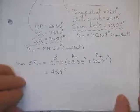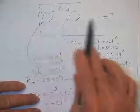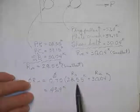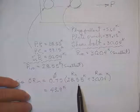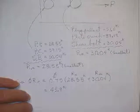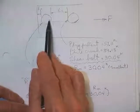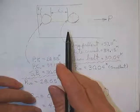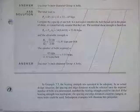Now, a little later on, they're going to say that we are going to design these things as if all the bolts take the same load. That's not quite true. As you notice right now, all the bolts are not taking the same load. So that's not a limitation, but it is only true if the bolts control everything. And I'll tell you now, we usually try and make these things so the bolts do control everything. Now, if you start finding that this thing here is controlling, your best bet is probably to move it back a little so it doesn't control. And you want to know it doesn't control before you start designing your bolts. So you can say, when you design my bolts, the bolts will control, and therefore I know how many bolts I need. All right. See you next time.